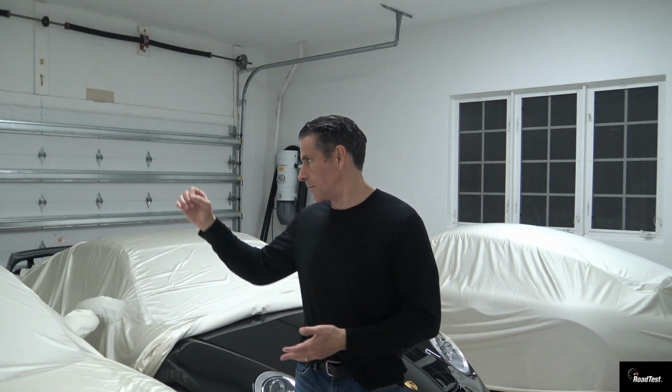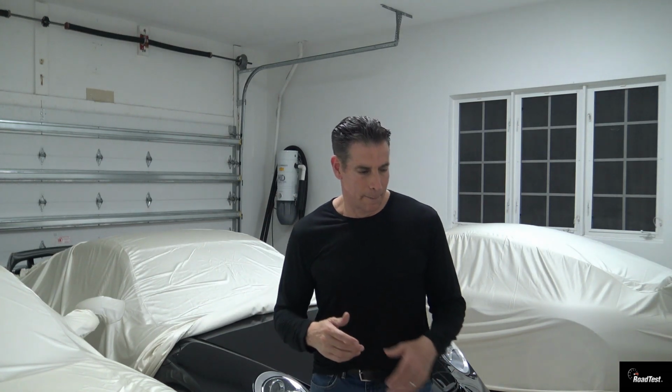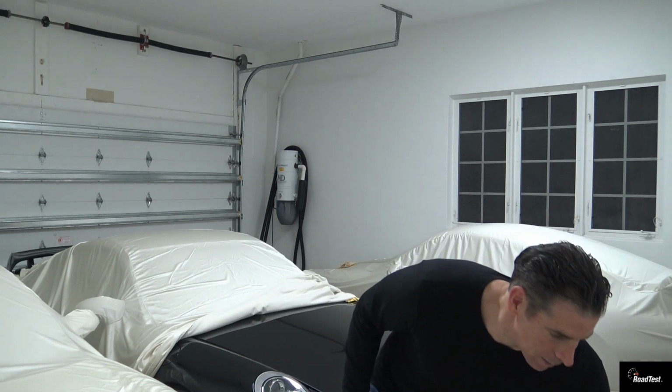Well, it's important because most cars that are painted at the factory, their paint is pretty uniform, especially newer cars. They're painted by robots, and the paint is laid on layers, and those layers have a specific paint depth. When you're measuring the paint on a vehicle that's been painted from the factory, the paint panel should be uniform, and I'll show you a paint meter device. This is what a paint meter looks like. And this meter here has saved me tens of thousands of dollars. So I'll tell you one story in particular, and I'm going to show you some video of the experience.